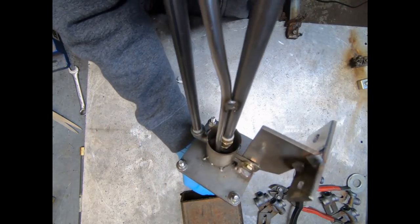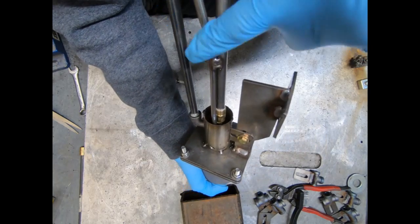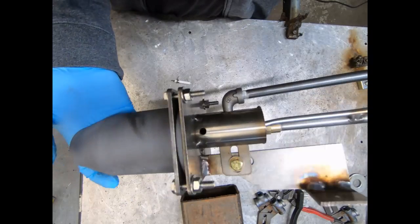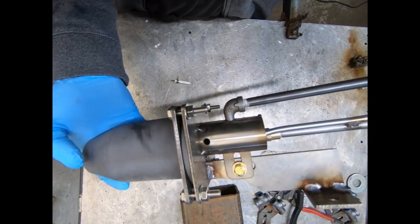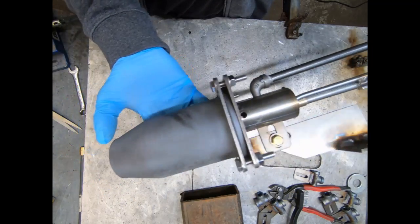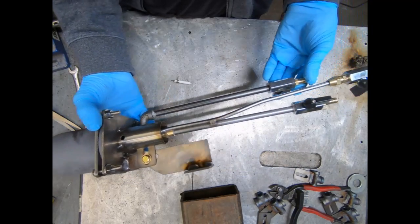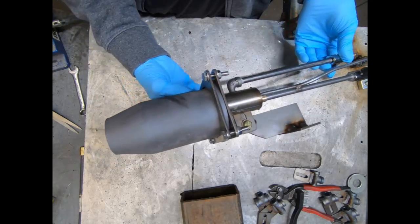This second rail is a secondary air rail that kind of keeps off-gases from diffusing into the fuel stream, which will cause a flame-out in some situations. This burner is going to be run at very low outputs, like 30 kilowatts.